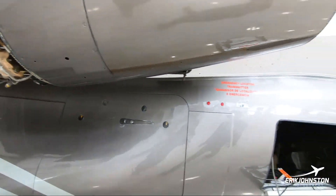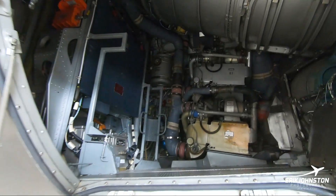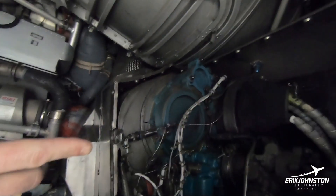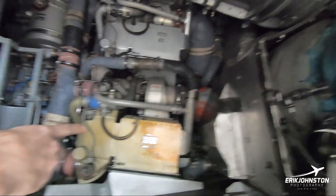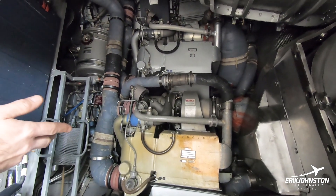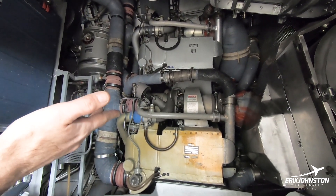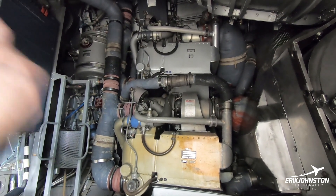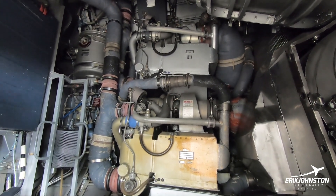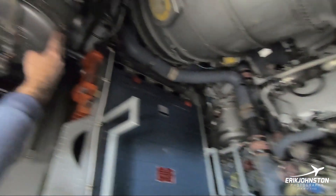This is a tri-holer — it's got three engines, which is pretty cool on the Falcons. The APU is back here. And these are the ECUs, environmental control units — that's basically where you get your air conditioning. They're not Freon machines; they're air cycle machines. Essentially it's a turbo — it compresses the air, cools the air, then depressurizes the air. When you depressurize a compressed gas it gets cold, and that's how you get the air conditioning. You have system two there and system one here.